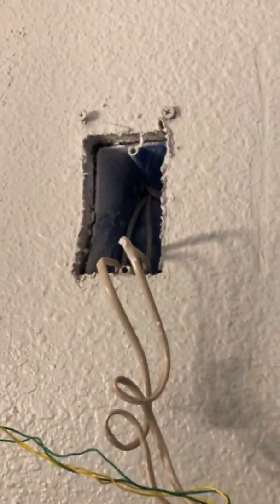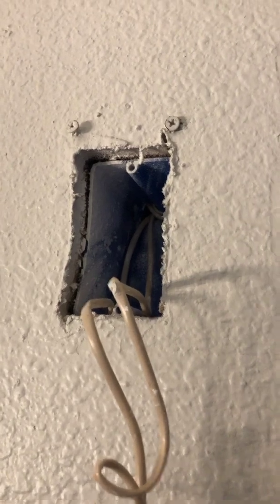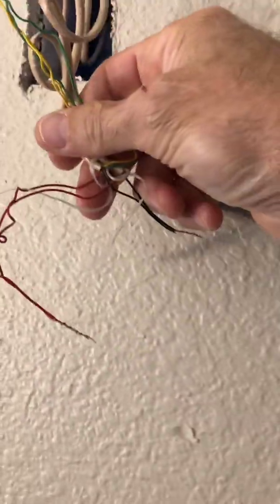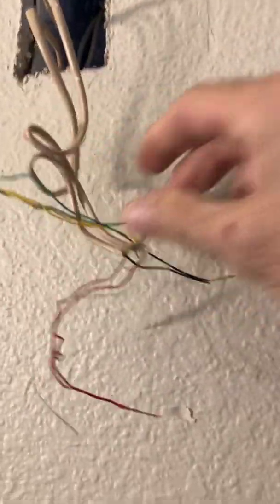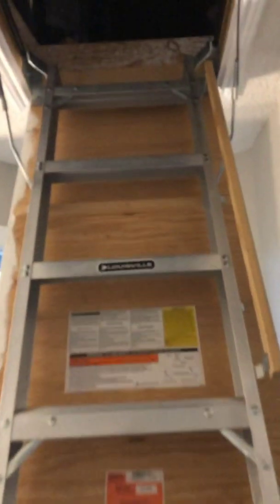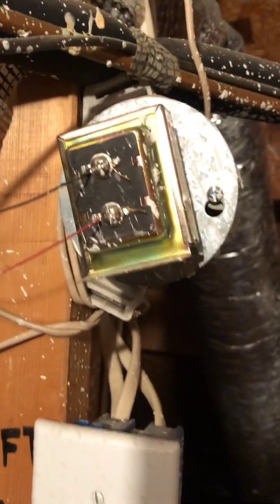You can find a dozen videos showing that you need to hook up a transformer, but in most houses when you get to where the old doorbell was and take it down, guess what — all we have in this box is more telephone wire. So I had to find the transformer. In my particular house, we go up to the attic by the water heater where the furnace switches are, because my furnace is in the attic too. And there's your transformer.